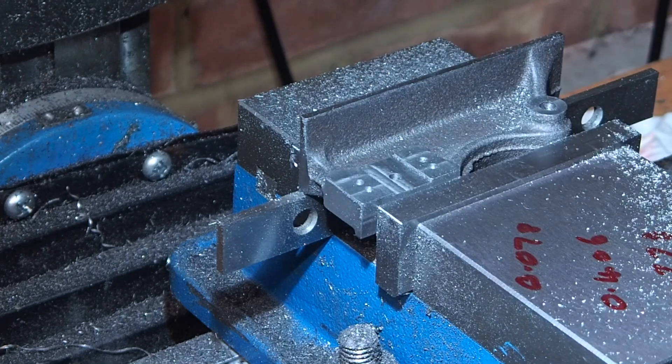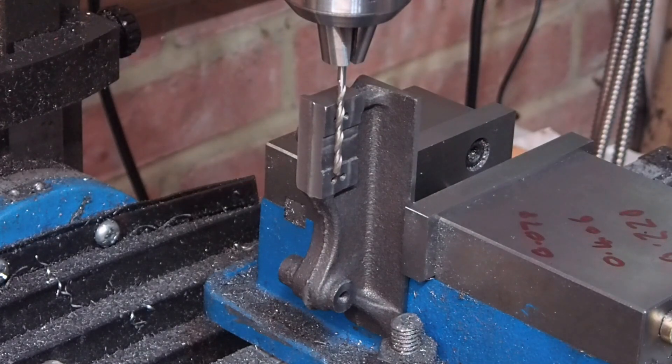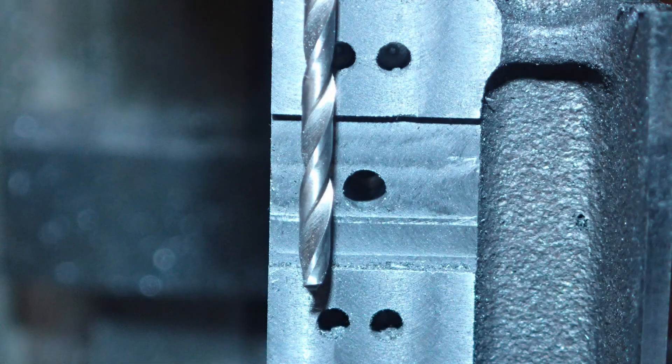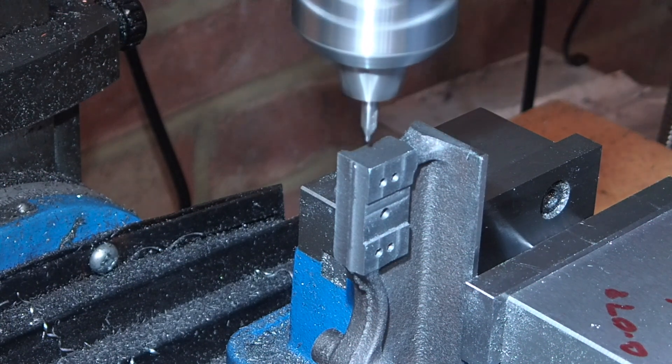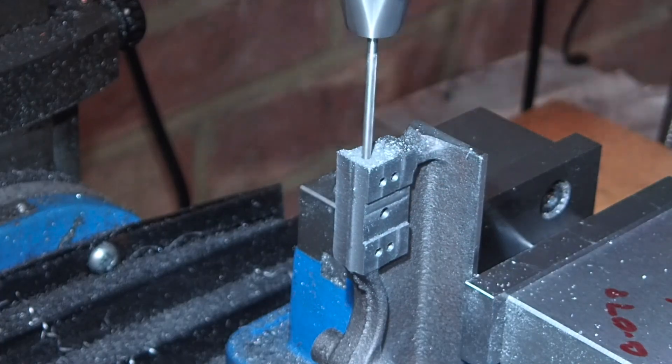That's it for this setup. Now the frame is set up vertically so I can drill the long steam passages. This is just a sanity check — I want to make sure that the passage will intersect with the steam ports by at least half a diameter and will give a good clearance with the pivot pin hole. Now it's a straightforward, if somewhat deep, hole to drill. I'll just speed it up and stop waffling.